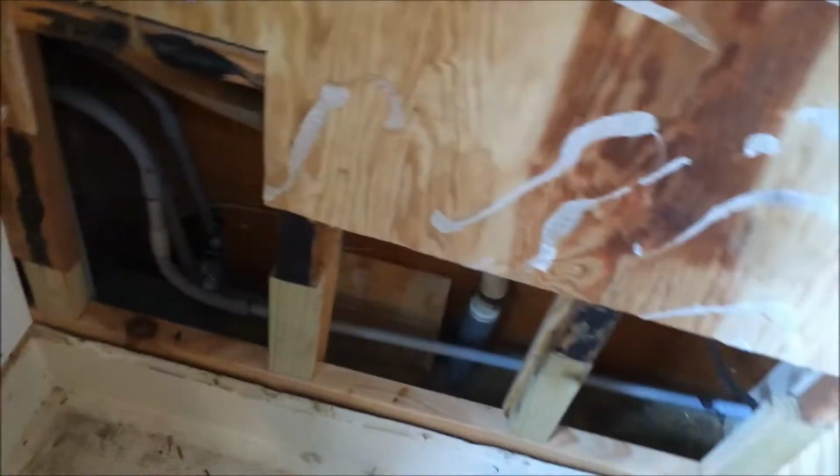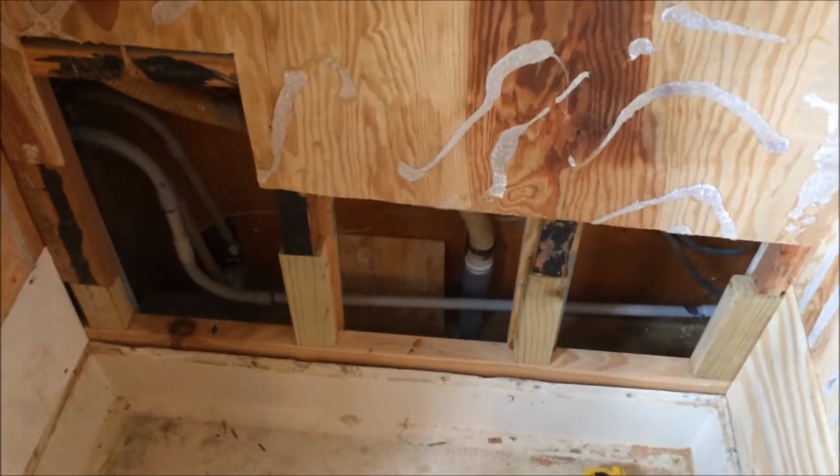I need to complete the air conditioner discharge water. I'm going to have to add a through hull closer down toward the water level so it won't make so much noise. And I need to add a big electrical cable so that we can have shore power connections on this side of the boat. And I need to run a thermostat wire from the air conditioner to straight above us in the front cabin. And then I can button up this hole and finish out this shower actually.